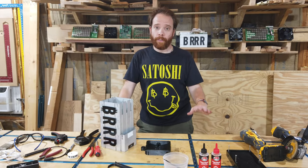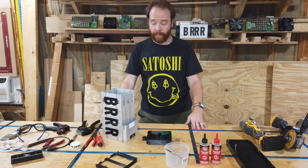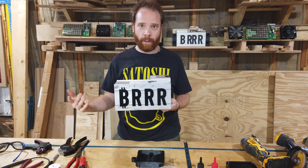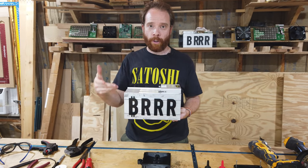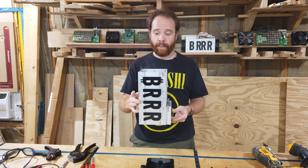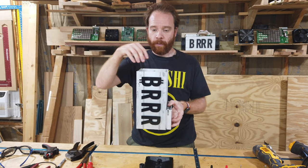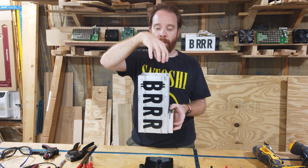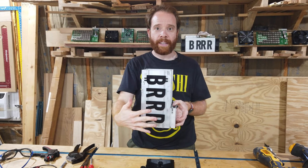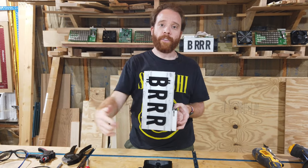Okay, now that we have mounted the radiator, we want to figure out how the oil goes through this S9. An S9 usually sits like that and gets air pushed from one side to the other, but in order to use the radiator, we're going to run oil through. To make this even easier, we're going to mount the S9 in a vertical orientation, and push oil from the bottom through it so that the oil goes around the casing and back out again. While it comes out, it will take the heat from the hash boards sitting in there, go through the radiator and come back in.